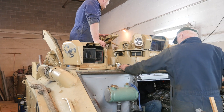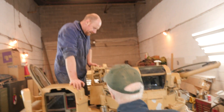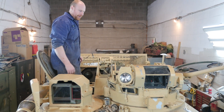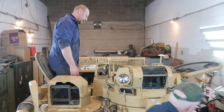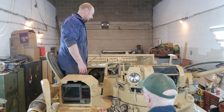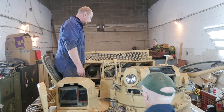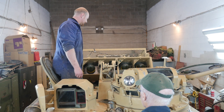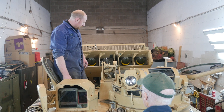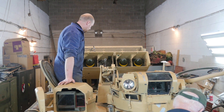Are you in the raised position or lower? I'm in the raised position. There it goes, coming up. The pump is starting to labour as it hits the stop — she's hitting stop. You can hear the pump start to labour. There's definitely a leak somewhere — you can see it dropping down already. Johan, could you drop it and try the pump again? Drop it down a bit and then try the pump. Going into lower now, then back on raise. It's dropping like a stone — keep pumping.